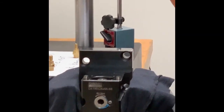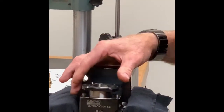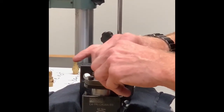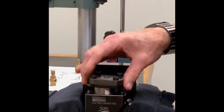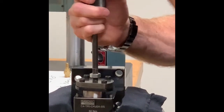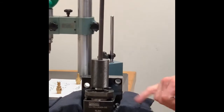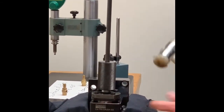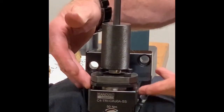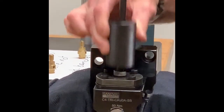As mentioned, there's a pin inside the polygon sleeve — we're going to move it to the opposite side of its original location and then reinstall that. You can put the withdrawal tool back on and use the slide hammer to reinstall the polygon sleeve, or if you prefer, you can use a soft blow hammer — that's okay too, you're not going to hurt these tools. Using the soft blow hammer does allow good alignment, sometimes easier alignment. The front face of the polygon sleeve needs to line up with the front face of the clamping unit. I'm going to use my soft blow hammer to rotate it a bit, which should line the dowel pins up — they do have a little chamfer on them, so they'll find their lead angle to go together nicely.